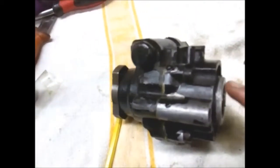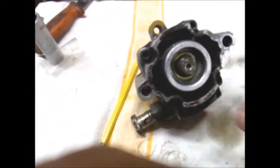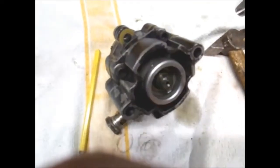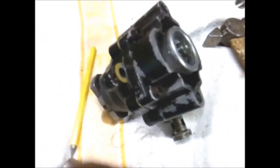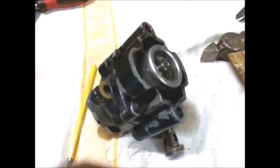Now the pump is closed with the 6mm bolts. You might have to tighten these a little bit at the time, with the tightening the opposite sides at the time. And if you are using different material for the gasket, you really need to get the thickness right, and depending on the material, you might even have to re-tighten the bolts after some time.